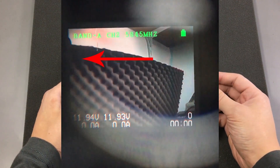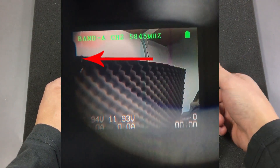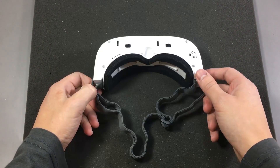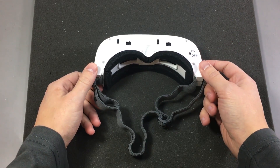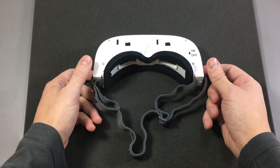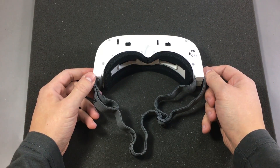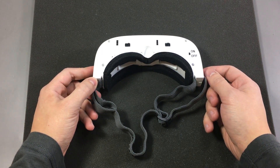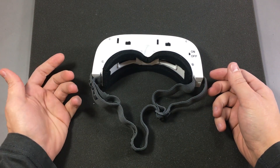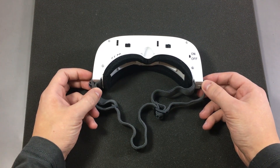Sorry for the poor quality — I was shooting with my phone through the lenses of the goggles. I get this black spot on the upper left and a bar of distortion across the entire width of the screen. At first I thought the issue was caused by the camera, because it is quite abused at the front of the airplane and gets hit a lot during landings and crashes. But when I used another pair of goggles, the issue completely disappeared, so that's when I started thinking it's not the camera.